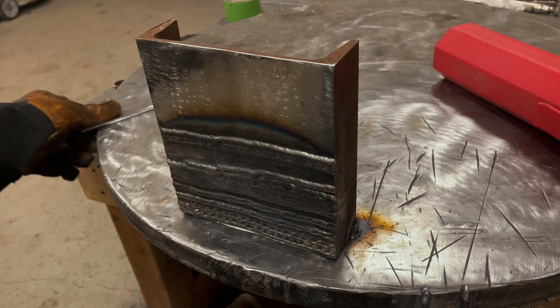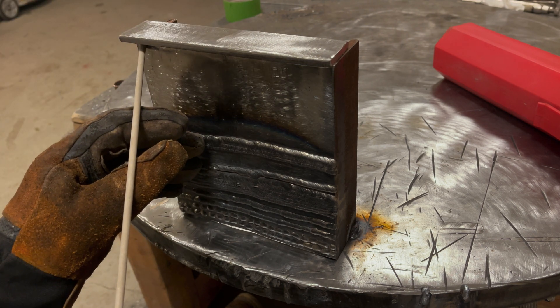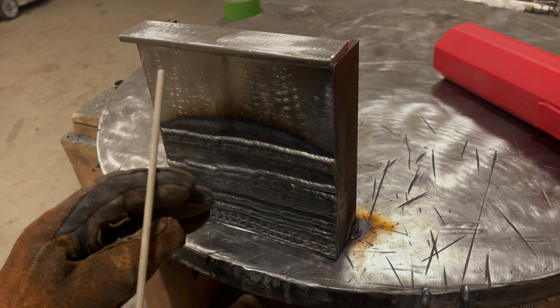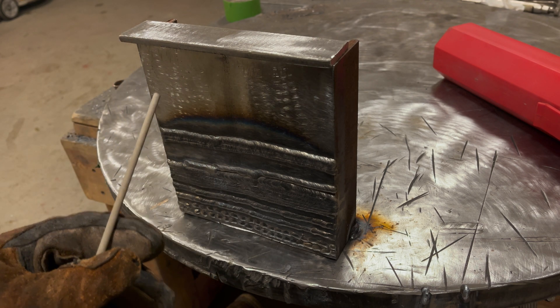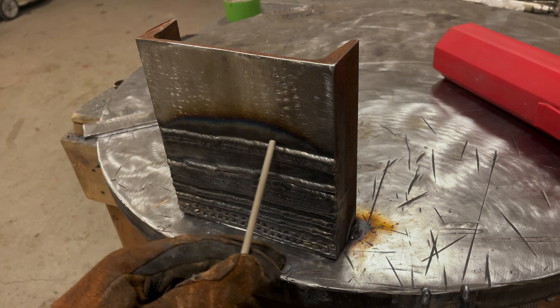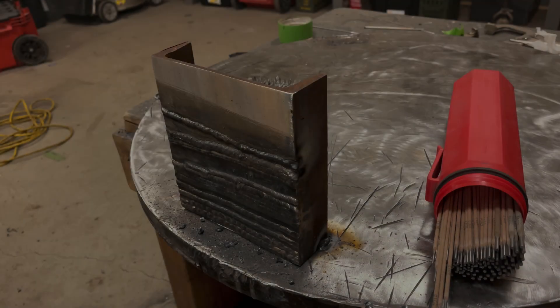This will also in a roundabout way teach you overhead welding. If you're doing a fillet weld overhead, you're also going to have a push angle upward. If you're really good at welding in the horizontal position, you'll find it's not that much different from overhead. 6013 is not the easiest rod for overhead or vertical up, but it's doable. What I'm going to do is run one pass here on top of this bead, then run another pass a little bit up to show you both welding on top of a bead and on its own, then we'll get into arc shots.